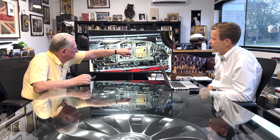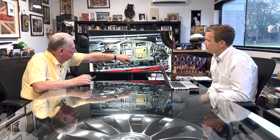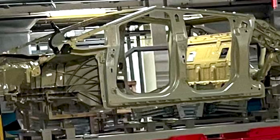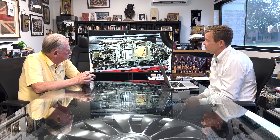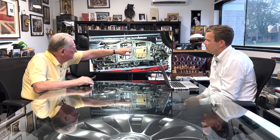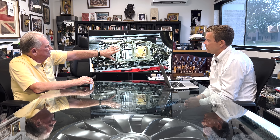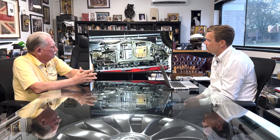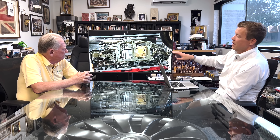Without a question of a doubt, I don't even need to see a closer picture. This is going to be boron steel — hot-stamped steel, ultra high strength, most likely. And I can see there's weld marks here and there. So this thing is going to be like bulletproof, literally. There's no way that anybody's going to crash this and have an issue. But at this point, there's no stainless steel here — there's no exterior yet. If you put the suspension on this, put a battery in it, the motors in it, put the seats in it, you could probably drive around.